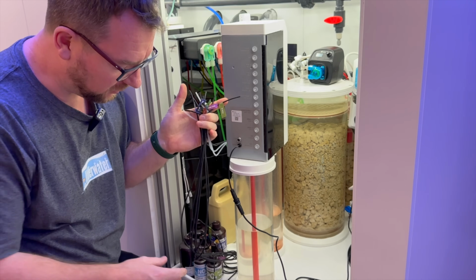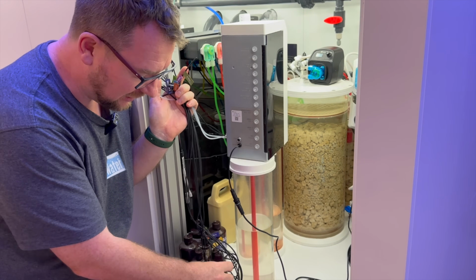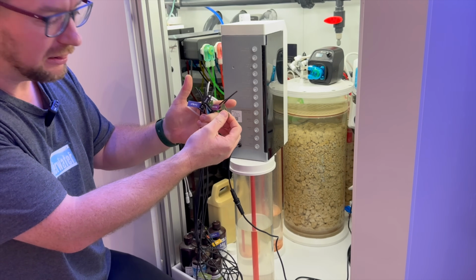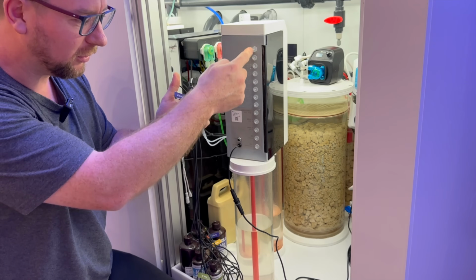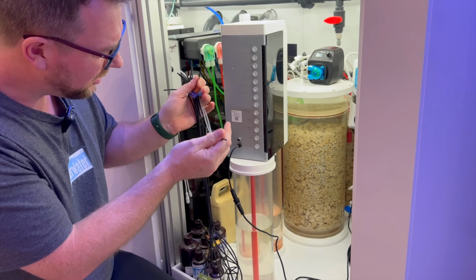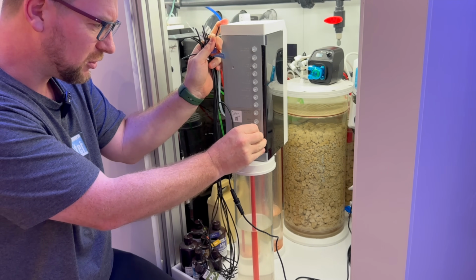Now, thankfully, due to the bottle caps that already have holes in them, the little extension and the connector you get with those caps, and then the very nicely labeled lines for each one, you just have to go through and connect them all up to where they point to. So this one is PO4B. Gonna have a look where that one is. Let's see, it's down here, PO4B. Simply push that onto that there,